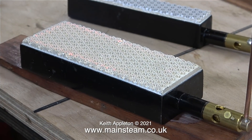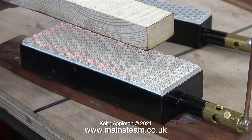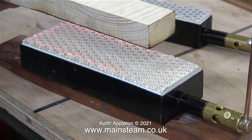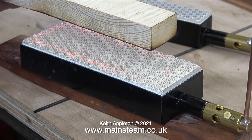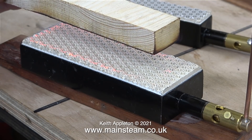I'm going to try this same number 8 jet on the larger burner for a 504 boiler. It's a bit on the small side — I think these larger burners are designed for a number 10 jet. But it's burning nicely, and as you can see, I have the gas jet pushed quite a long way into the Venturi tube.